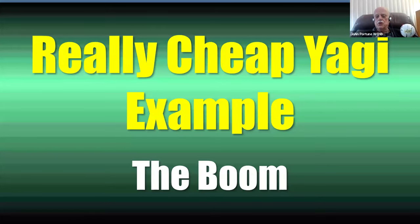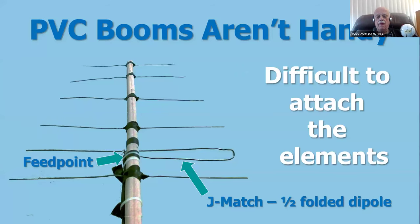So let's build a really cheap Yagi example. And this is the one at the director's dinner at the ARRL here recently that got a lot of compliments. Let's start with the boom. Okay, here's what a lot of hams think they should use for the boom to build a homebrew Yagi with: a piece of PVC pipe. No, don't do that. Don't go out and buy a piece of PVC pipe to build the boom for a homebrew Yagi. Why? It's really tough to mount the elements on. And although I think this particular Yagi probably worked fine, this guy had a lot of difficulty getting the elements mounted. You can see all that electrical tape to try to hold it on there. It worked, of course, but that's Mickey Mouse. That's not easy. So don't use PVC pipe to build homebrew Yagis. That's not the way to go. It'll work, of course. And I'm sure this Yagi worked just fine.